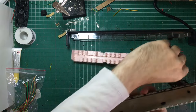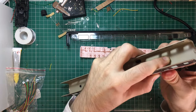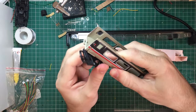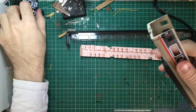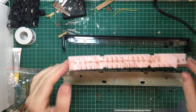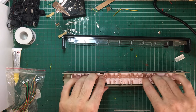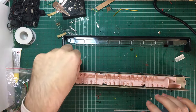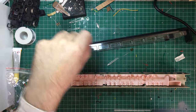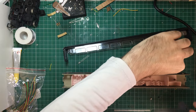So let's start taking this coach apart. These Hornby coaches — the roof comes off and that gives us access to everything inside. Just being gentle here to make sure that nothing snaps. These coaches also have the benefit that the seats all come out as one, and that's going to give me a place to hide all the wiring. I'm actually going to run all of the wires underneath the seating. Just removing the wheels to make it easier as I need to drill some holes, and then I'll quickly lay out everything in the rough order it's going to sit in the carriage once it's fully built.